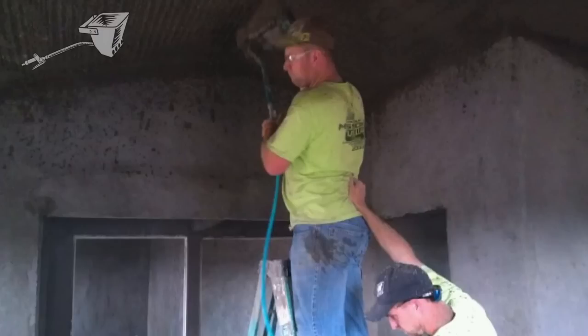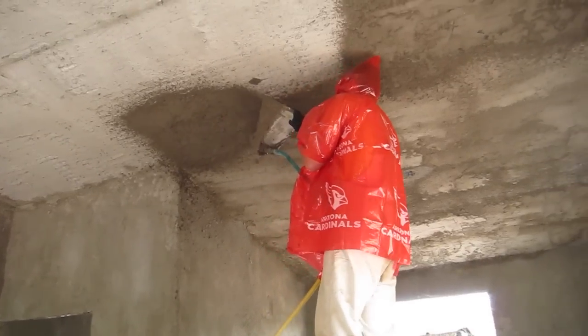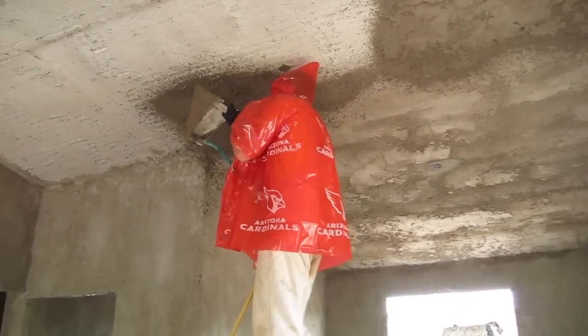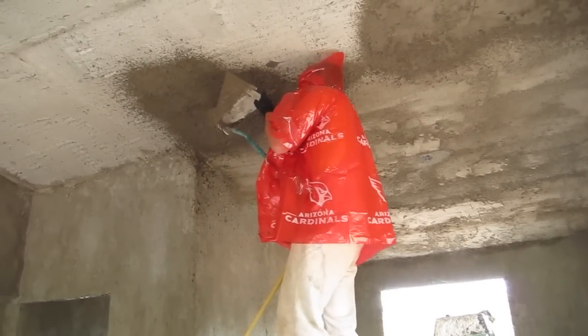You can see that it's the white polystyrene with wire mesh — all of that is covered. We hook it up to a 12 CFM air compressor and stucco sprayer, and we spray anywhere from two to three or four layers of stucco on the ceiling, depending on the thickness.